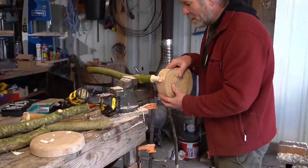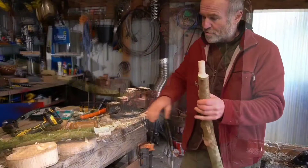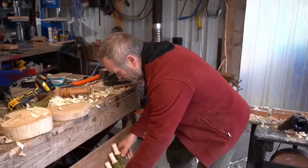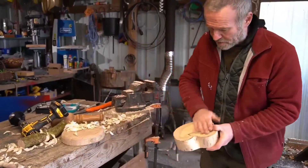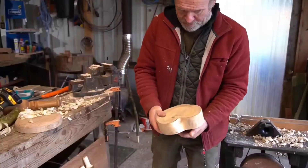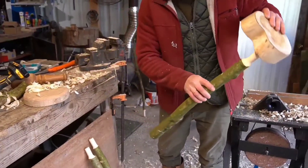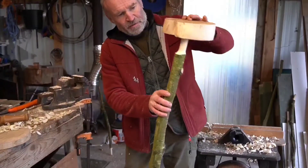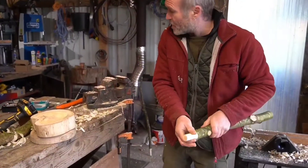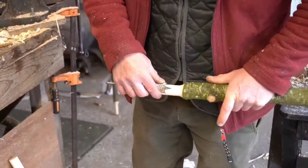So we'll imagine that's about halfway — just all three of these. So that's three dowel ends cut. Now I've smoothed off this side so we're going to actually use this as the bottom. And we're drilling just the holes now. We drill them at a slight angle because it'd be nice if they sit at an angle rather than straight down. So you need to find something that fits this — I know it's actually an inch. We can use our inch spade bit to drill that.